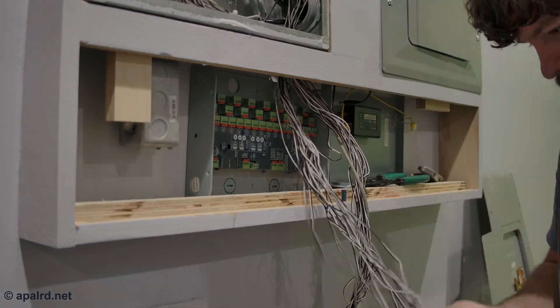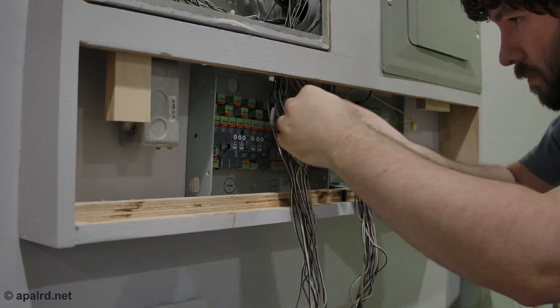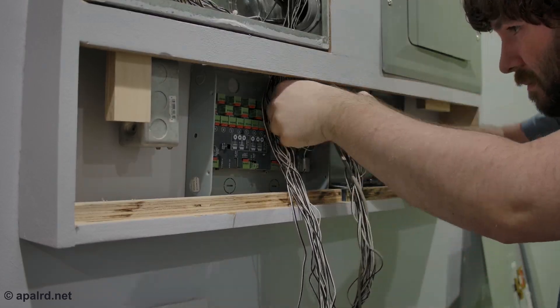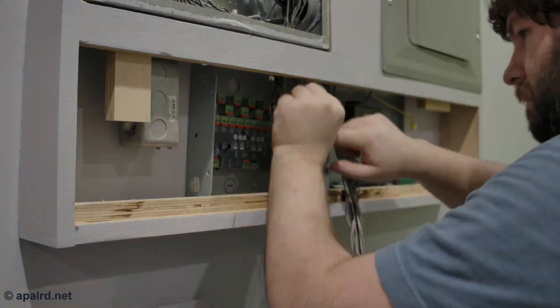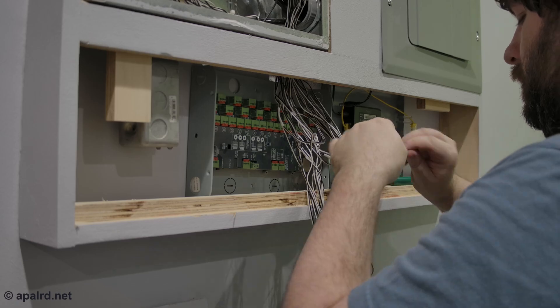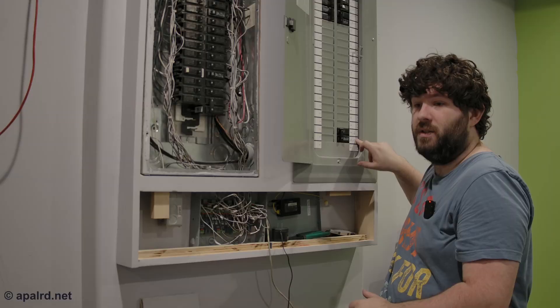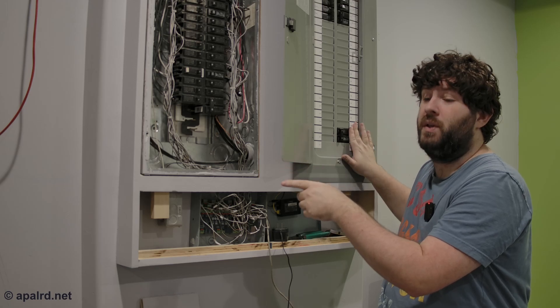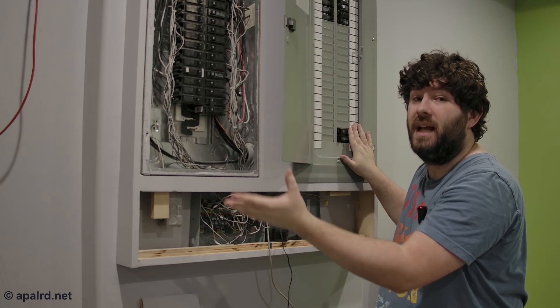Most people, when they set up a meter, think they'll monitor their main and maybe a couple other circuits. But I took a different approach: I want to monitor absolutely everything, so I need a current transformer on every wire, every breaker. As soon as I do that, I don't need any big ones anymore — I just need a current transformer for each load, however big that is. I don't care about the main because I can just add them all up. This is the 60-amp sub-feed breaker that feeds that panel, so I don't need to monitor this one because I already have every single circuit in this panel monitored — I can just add them all up.